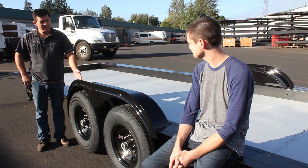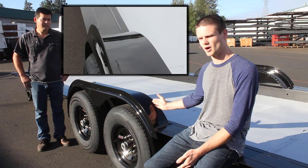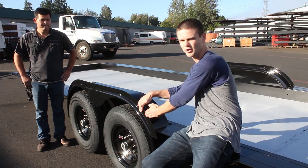Another option is fender flashing, and the purpose of this is to prevent weather and rain from entering your house. This is a really important option for us because of our rainy climate, and the way we made best use of it was to bring our wall framing up right in behind, and then have our exterior sheathing come down in front to layer it for water shedding.